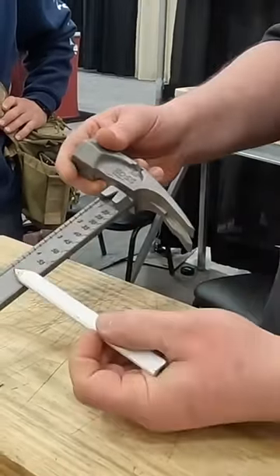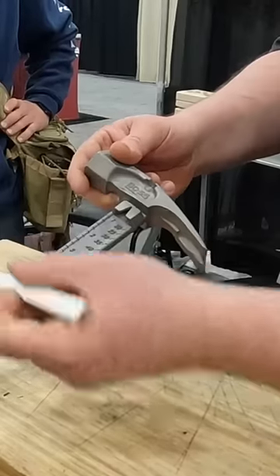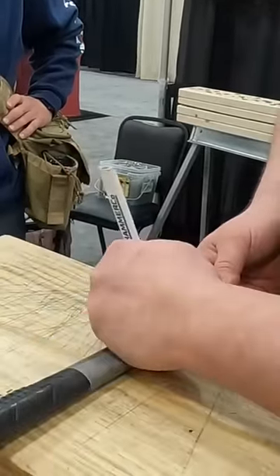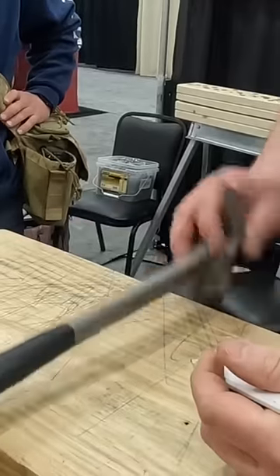You've got a quick reference stick rule right here off of this shoulder out to 5 inches, so if I want a 2¼ inch rip real quick without pulling my tape measure out, there's 2¼ inches. Flip it over.